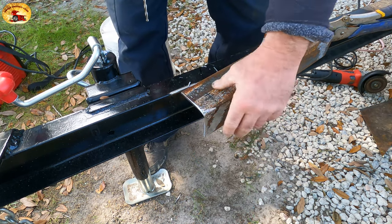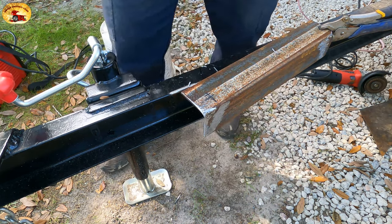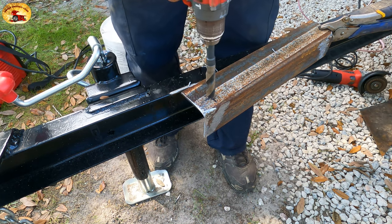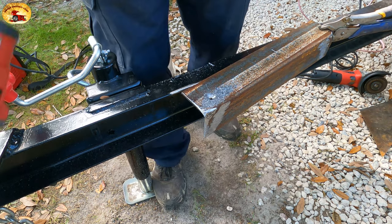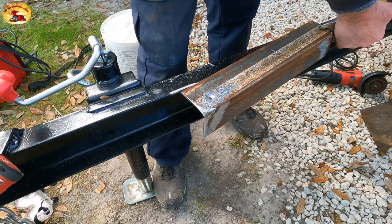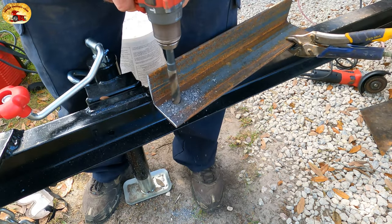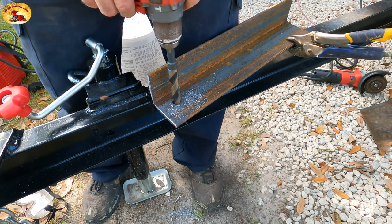Like that. Pretty close. Close enough for rocket science. Remember, small drill bits, faster speed. Bigger drill bits, slower speed. All right, we're going to turn it over and go from the other side, because I know when that grabs, breaks through, it's going to rip my arm off. And you can put it in your drill press, which I know you all have. I'm barely even setting it in there on high speed, just to slowly work my way down through it.